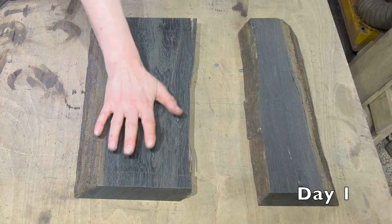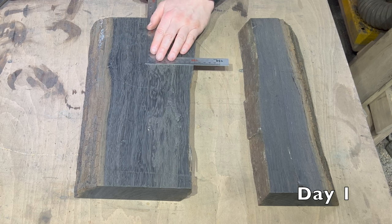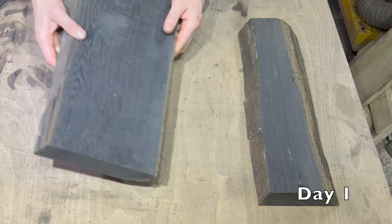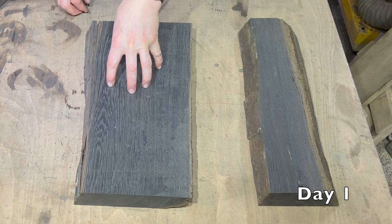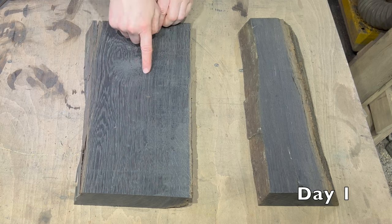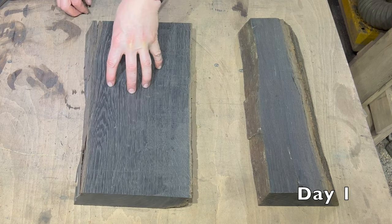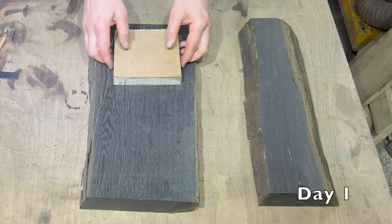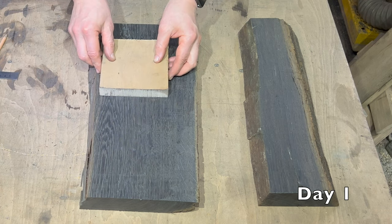That gives me enough room to glue on the counterweight to compensate for the extra weight on that side on the lathe. Next thing is I want to put this in the right place on the back — marking up the piece, marking at the side, flip it over. You'd think the chuck grip would be more central, but with that slant the middle is actually there. I put a 10 mil hole through for my screw chuck so I can find it later and go straight on.